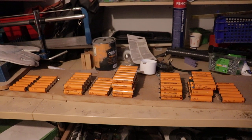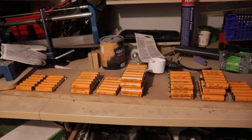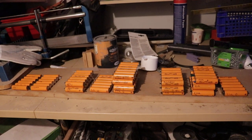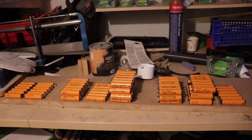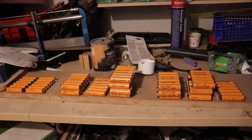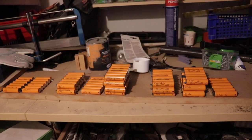So yeah, what I can gather from this is just that the quality of these cells is what's caused this issue. It's just such low-quality componentry that this is what happens. This is a battery that's two years old — it's got maybe 20 cycles on it, and most of the time it's spent just sitting around. I don't have reason to suspect it's been over-discharged or over-charged. For all I know, this battery has not been abused by the user. The user was a lovely old lady who barely used the device they were shipped with.